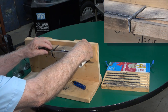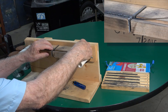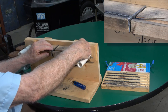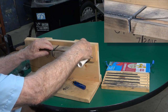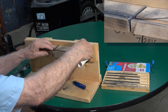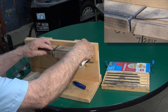So I clean these with, I can't even remember what it is, but a good cleaning agent that took off ink, grease, and all sorts of stuff. It's actually the orange, what's the orange something, that did a good job on it. It cuts through the old ink and all that stuff because these are previously owned or used slugs that actually printed. So cleanliness is key, and you pull the band tightly so that this slug butts up really tight to the previous one that's clamped on.